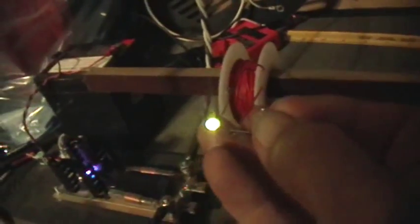I've been playing with different capacitors, and of course you're tuning the system to the transmitter by doing this, so your capacitances will vary. This is a 47 — or it might be 470 picofarad — little ceramic capacitor. What I'm going to do is just put that through my loops here so that it will be in the circuit. I've rehearsed this. So now I've just stuck that capacitor in through the loops that I'm using to mount the LED.